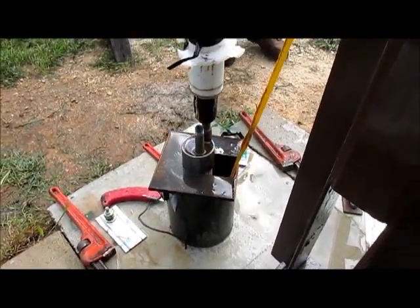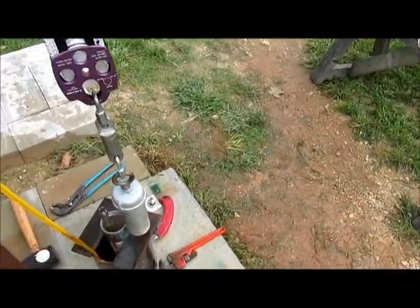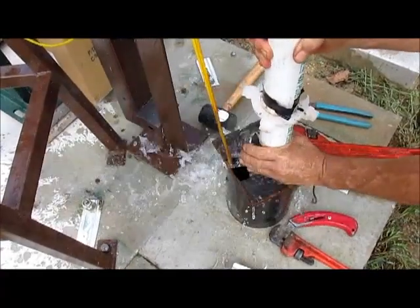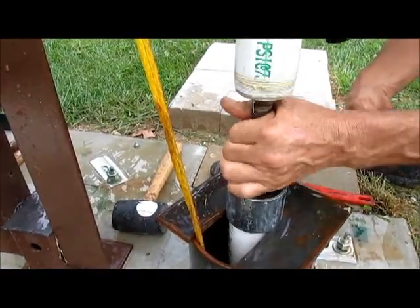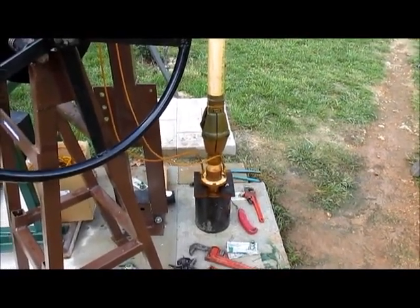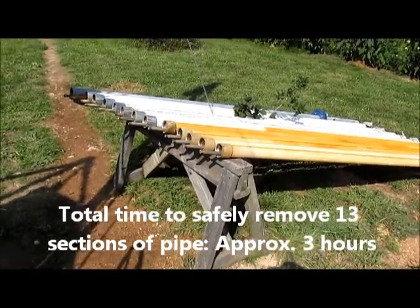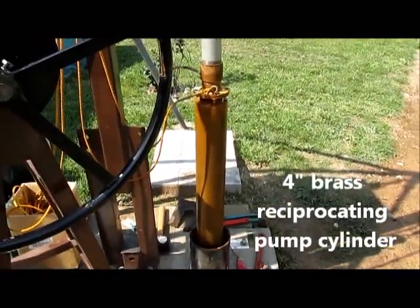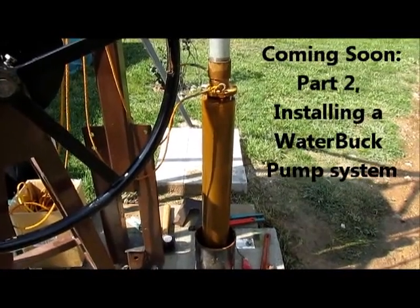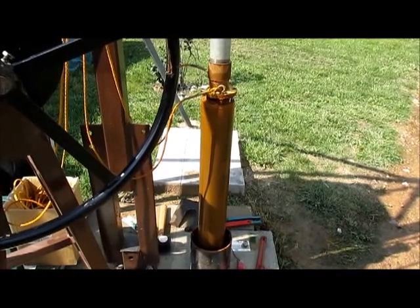The rod is disconnected. I made it to the last piece of pipe — the 13th one. The cylinder is down underneath. 13 joints of pipe with 3/8 sucker rod — inadequate for the mechanical advantage of the Waterbuck pump. There's our four-inch brass cylinder. Stay tuned for part two: the installation of a Waterbuck pump with another four-inch cylinder, and also stay tuned for a surprise — a significant change in the mechanical advantage of the Waterbuck pump that will make it even more awesome.